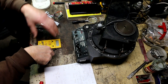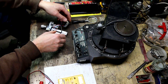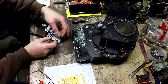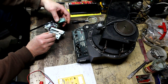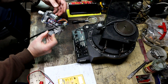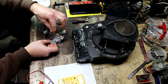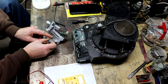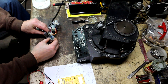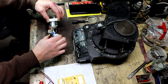I decided I wanted to play around with this some more, so to make my life easier I took out the declination assembly. I removed one screw — there's a plastic spacer underneath it that holds this board on. When I took out the two screws that hold this into the fork body, this spring fell out. It actually sits right in this little pocket here. You have to close this up and hold it closed when putting it back in, because the spring sits in the pocket on one end but the other end just pushes on the back side, preloading this assembly.